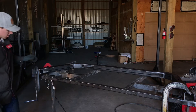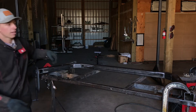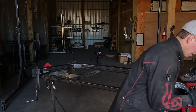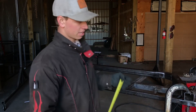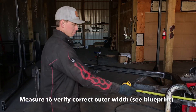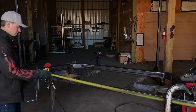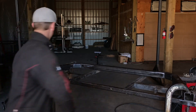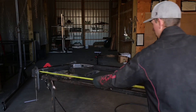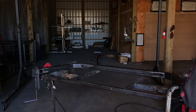Once you have your two sides clamped, these edges should be flush with the edge of your table and the overall outside width should match the blueprint — 71 inches for Dodge, 73 and three-quarters for Ford. I'm going to go ahead and measure to verify from outside to outside. Mine is 71 on the dot, so I'm going to call that good.